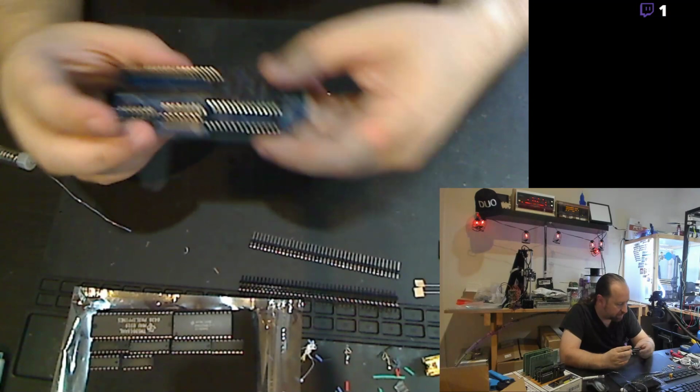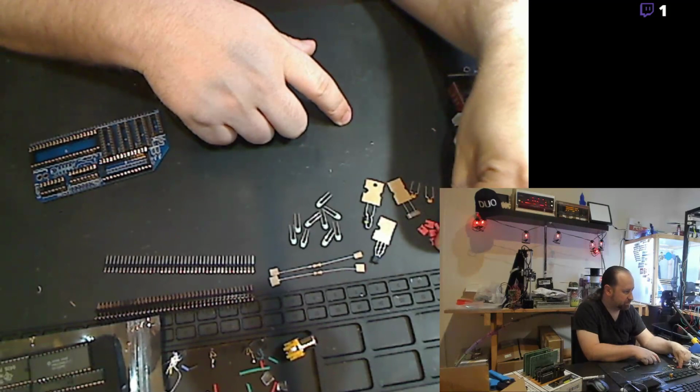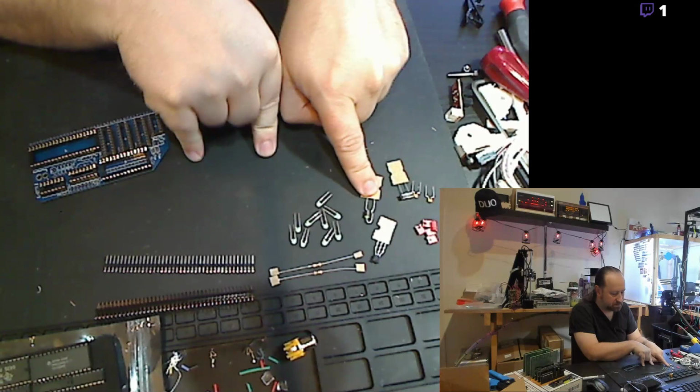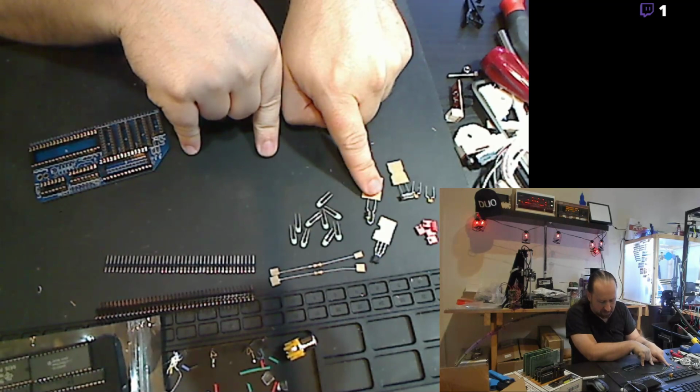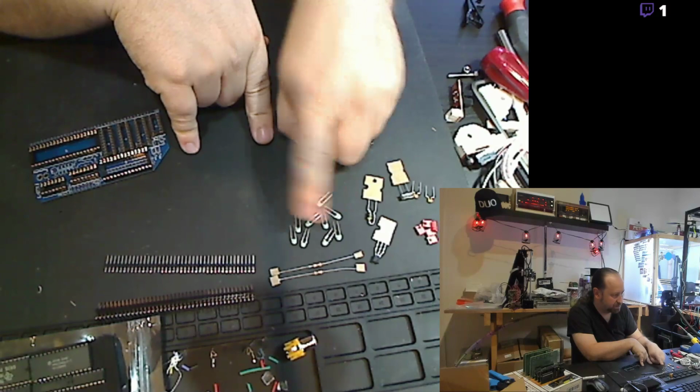All right. So let's see. Actually, there's a few components over here that go on. There's just some basic jumpers over here. There's a crystal with a couple of capacitors just for the crystal. There is a ferrite bead, which goes on the video output. Also coupled with this transistor that goes on the video output. Some generic decoupling capacitors that'll go next to all the chips. A couple of resistors for the video output, and then this card will be pretty much complete.